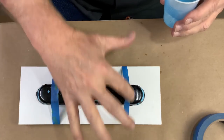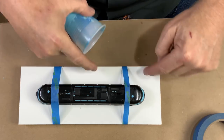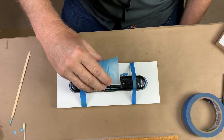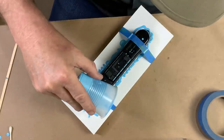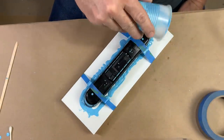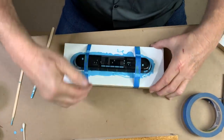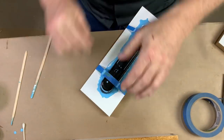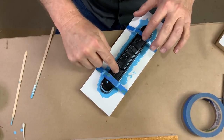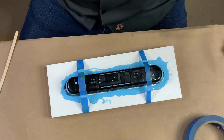The next step is that we need to seal the locomotive part to the base. It's held in place by these two tape straps and it's pretty flat — it's got a nice contact between the part and the base. So what we want to do now is just make a gasket. I mixed up a small amount of rubber and we're going to see if we can pour a gasket. We want to seal that edge without pushing a lot of rubber underneath the part; there's just not enough weight of rubber to jam it underneath to overcome this downward pressure, and we should get a nice crisp edge around that part.